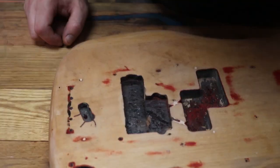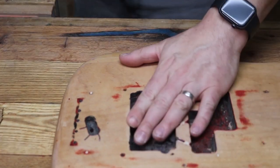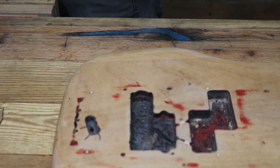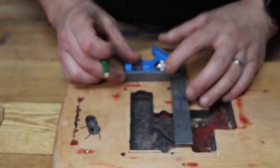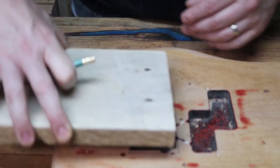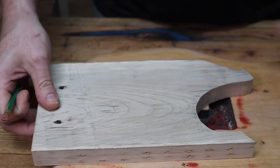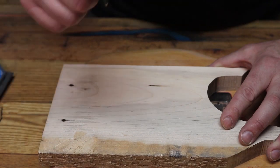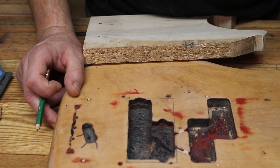What I intend to do to solve for this is make one big square with rounded edges that match the round over on the router bit, so I can, let's draw some boxes here. What I want to do now is measure it up, and I want to translate it to this piece. I want to cut this piece first, and once I cut this piece then I will put it back on here and then trace around it and cut the hole to match the plug. I think that's going to be the best order of operations.